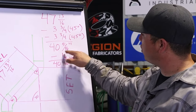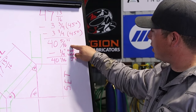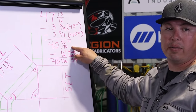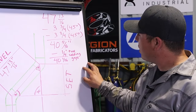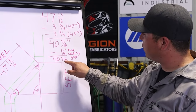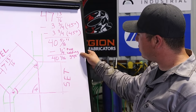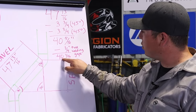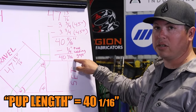After doing the math it came out to 40 and 5/16 of an inch. Also to note: when you're working with TIG you have to account for your gap as well. I took off an eighth inch for each side, giving a total of a quarter inch for our two welding gaps. Doing our math, the piece of pipe we need is 40 and 1/16 of an inch.